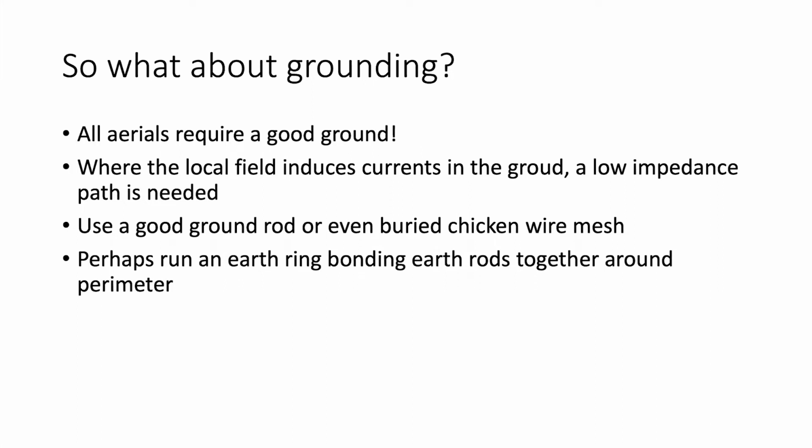And this just improved my signal to the point where one American said I was like a beacon on top band. I always used the same frequency, and they always used to check to see if the beacon was on the air, and that was me. That's the compliment, isn't it? And it did pay off, and that was about 7-8 years ago now. Since then, I've got 280 plus countries on top band, which is a fairly impressive figure. Of course, they're very difficult to find from now on. But the wire around the perimeter with earth rods is very good.